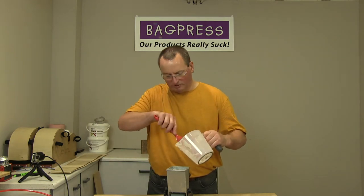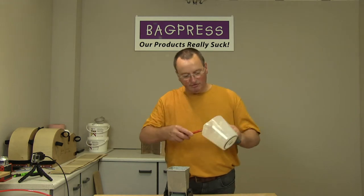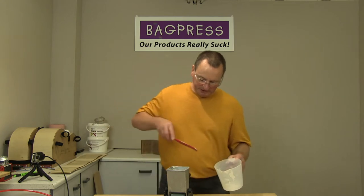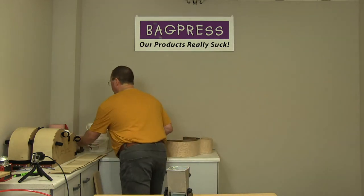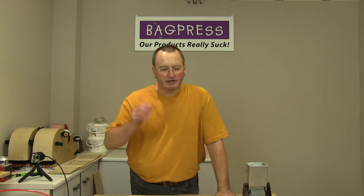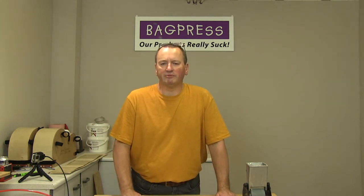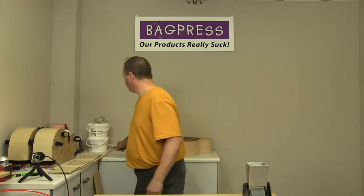Because you've got such a long open time on this glue, there's no rush. If you do a mix and for whatever reason it comes up a little bit short, yeah, that may even be the case this time, we'll find out, so you're part way through gluing up a side, that really doesn't matter. You've got the time to stop, do another mix, only take you a few minutes, and then top up the glue spreader and off you go again.